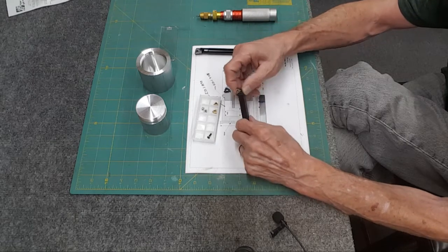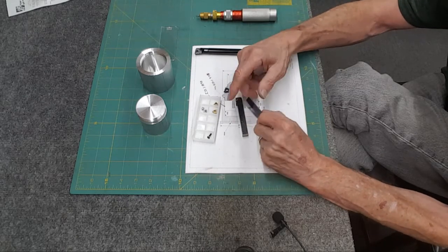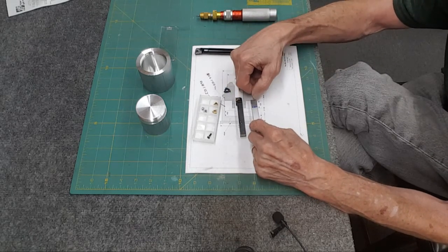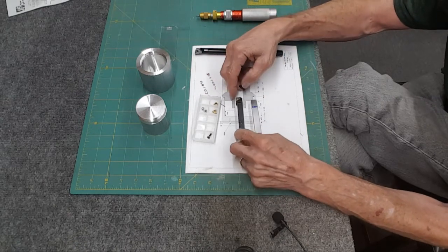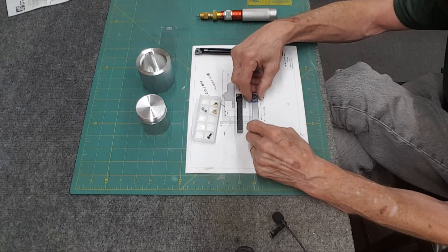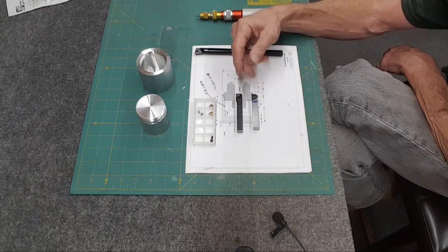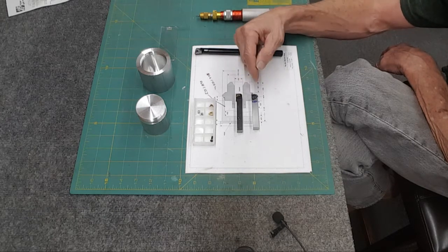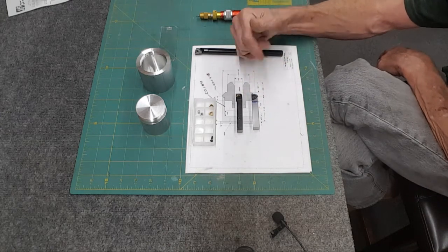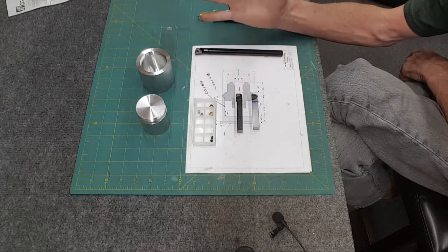This thing also has a cut on it, so that would be easy — I can just put it in a D-bit grinder and have a nice face and the angle. Then all I have to do is cut this off and do the hole. But the more I keep looking at it, the more I know I will not be happy with this, and I'd like a nice holder. So I spent hours and hours researching and I found one — it's a lot of money, about $80 for the holder, but it'll fit in one of my lathe holders.